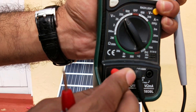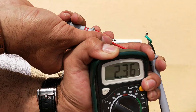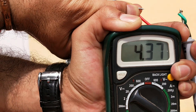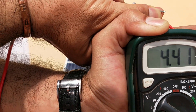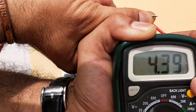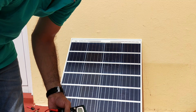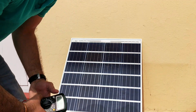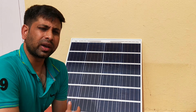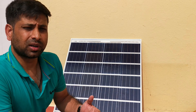For current measurement I'll place it to 10A DC — my multimeter supports only 10 amps. Changing it to 10 amps, connecting plus and minus again — you can see it is around 4.2 to 4.4 amps. As the sun keeps increasing, I think it will end up around 5 amps, which matches what they specified. With a solar charge controller stepping it to 13 volts to charge the battery, I think I can fully charge my 45 Ah battery in about 6 hours — from 9 o'clock to around 3 o'clock — and then use that charge as backup through an inverter.